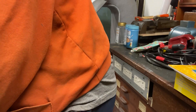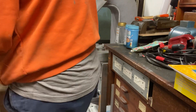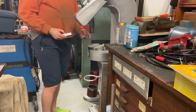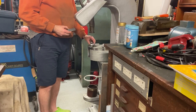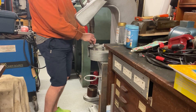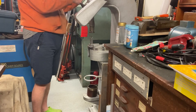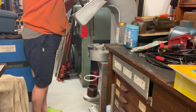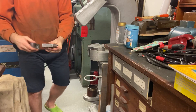I'm going to do it on the press now. Because the blade is very close to the size of one of the slots on here, I've made this as a base plate so it can be pushed down into that. I put that over there, put it over the top, bring it down — and that's sheared the rivet off.